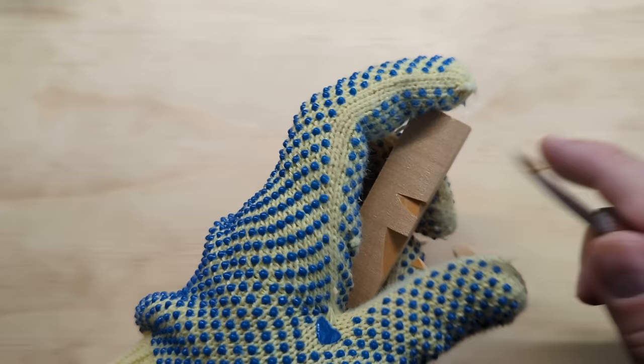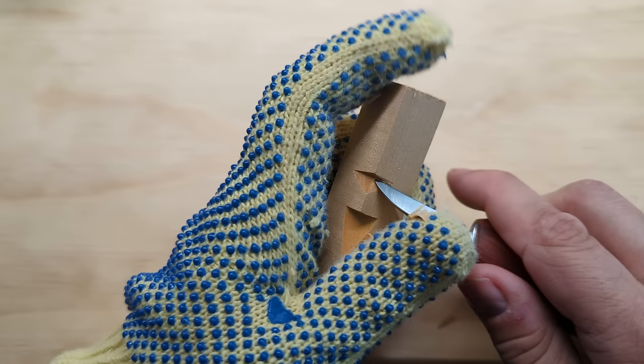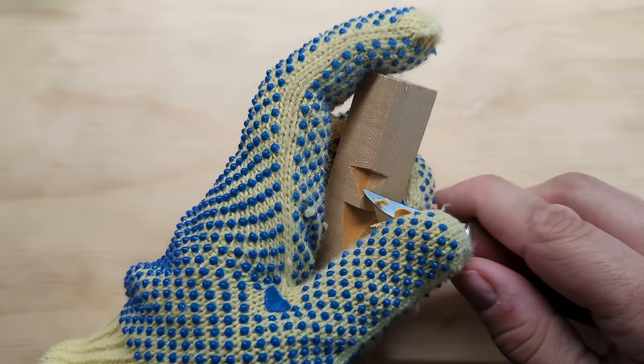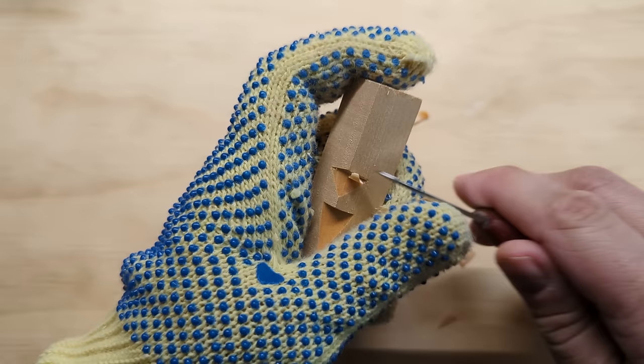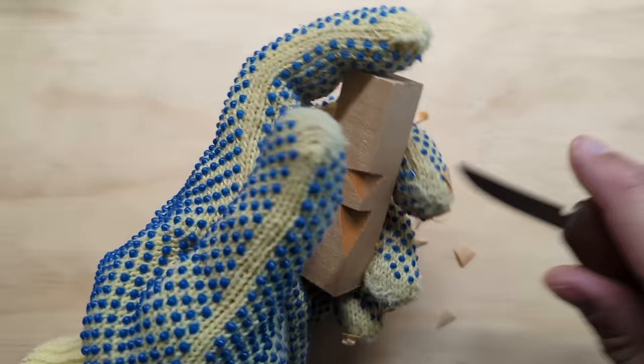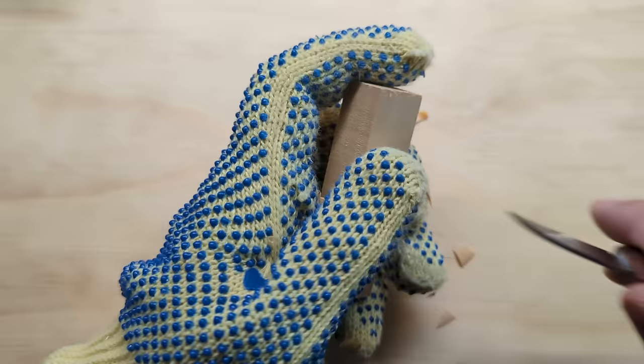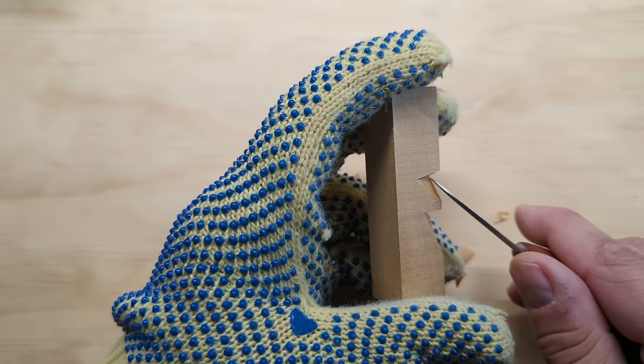And I'm going to keep carving down a little bit further on the nose. Okay, but I'm trying to pay attention to that right side of the line and keep that in line with the corner above and below. Okay. And I'm going to do that a few times until I've got a nice symmetric cut. I'm not going to go all the way down to the tip of the nose. I'm going to leave the tip angled like that. And I just want to make sure that I've got that ridge of the line going right up in the middle. Okay. So if this is going back, you know, about halfway through the face of the wood, this is probably going back at the deepest part here, about a quarter through to the side of the wood here.